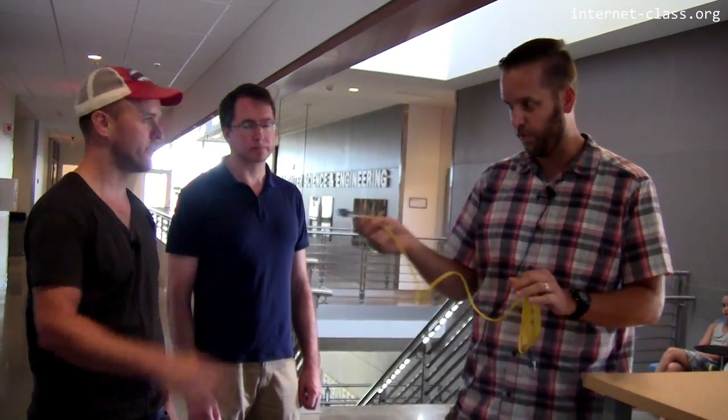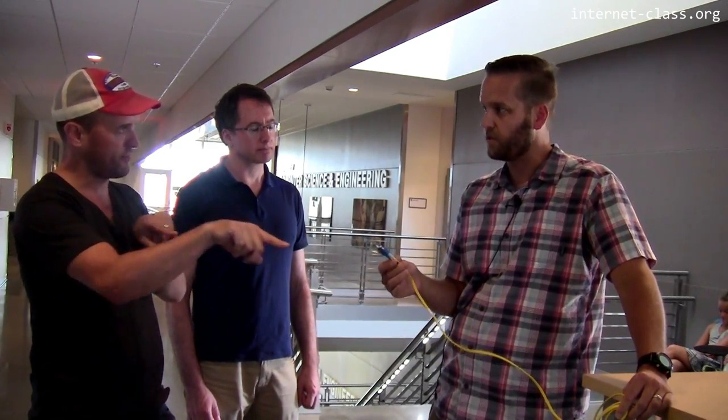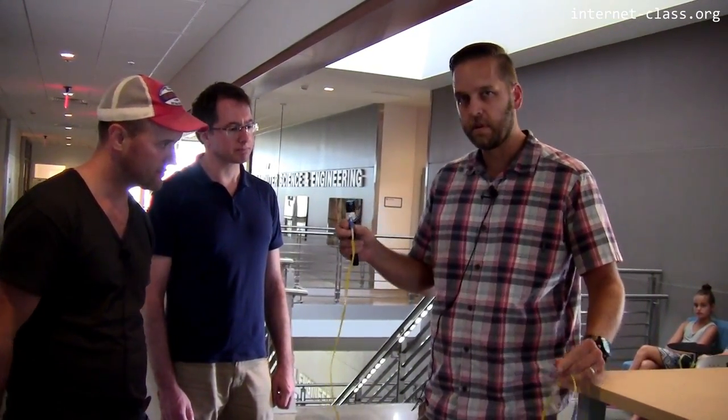Okay. So you may have seen the patch cords that are made out of copper. A lot of people are used to those. Now, this is a patch cord as well, but this is with fiber optic cable. The copper cable had eight wires. This only has two, and typically it's for a transmit receive scenario. So they're going different directions. Exactly. So for duplex communication. This particular one is a single mode fiber, and the glass on the inside is 10 micron diameter.